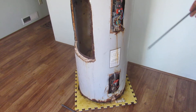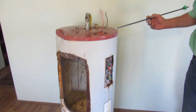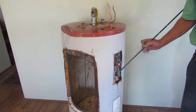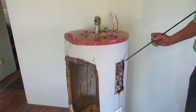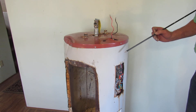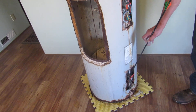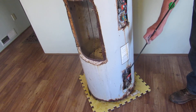That's really all the parts of a water heater. Now let's talk about repair. First situation: you don't have any hot water whatsoever — just replace your upper thermostat and upper element, make sure your breaker and wire connections are good, and that should solve your problem. Second situation: you have hot water but run out really quickly — replace the lower thermostat and lower element, and clean out the sediment at the bottom of your tank, and that'll solve your problem.